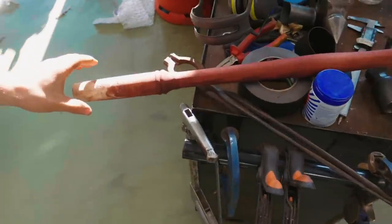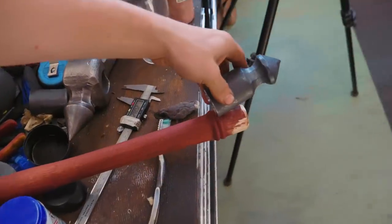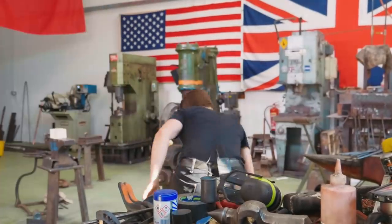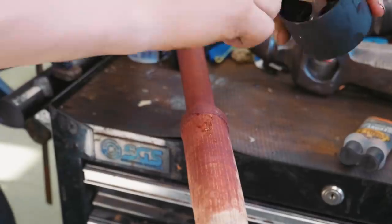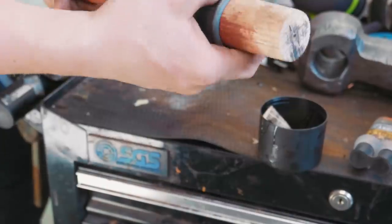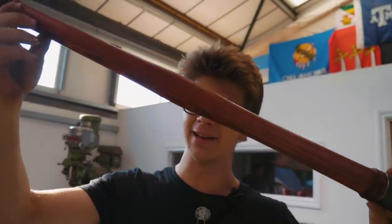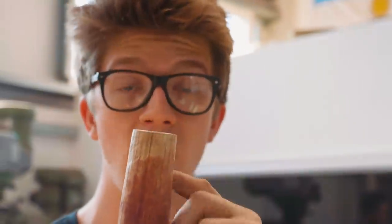The pins have actually ended up super-glued in — hopefully that holds well. The pins are super glued into the stag heads, which is great. Now it is time to begin putting all of this together. We're going to mix up some two-part epoxy — this collar gets epoxied on, the stag gets epoxied on. We're going to abandon the cold blue idea; I really don't think it made enough of a difference to matter, and the scale finish is beautiful enough as it is. We'll cut a slot in the handle to accept a wedge so that as it gets driven in, the wedge opens it up and locks it tight.